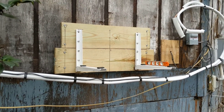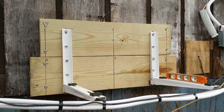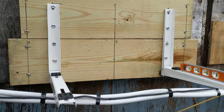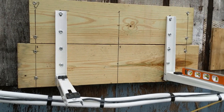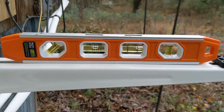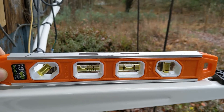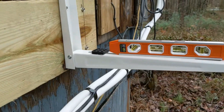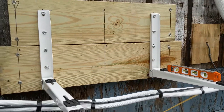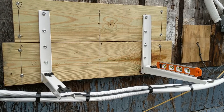I got the mounting bracket up. My building is not incredibly level — it's 1960s vintage so it's got some issues. But I do have these properly spaced and they are level side to side. It does appear that I'm going to need to shim a little bit front to back, probably about the width of a good-sized washer, but it's equal on each side. I've texted a friend from work to get a hand lifting this thing into position, so I'm just going to take a break.